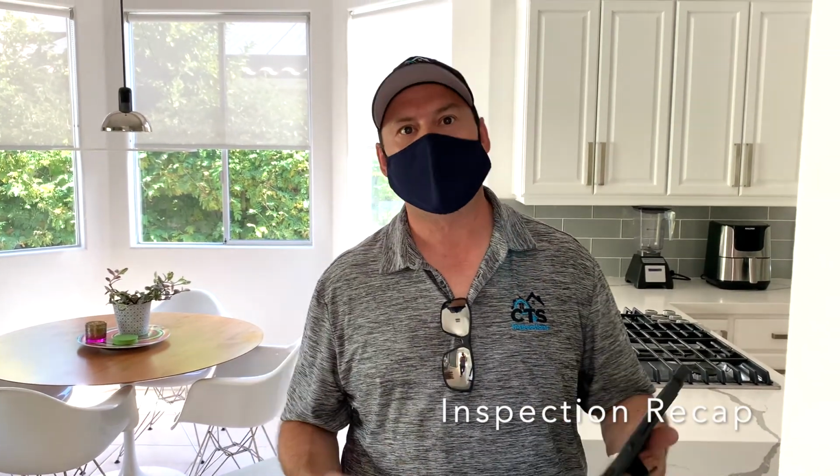On the roof, which we're not going to go up, there's about 3 or 4 dislodged tiles where they've slipped down from one another that need to be tucked back up. Okay. The vent pipe to the water heater, the cap to it is blown off. It's missing the cap to the water heater vent pipe on the roof. Okay, and the slipped tiles, they're still in place, but they've just slipped down? Yeah, they just got to be tucked up with some glue, some adhesive.